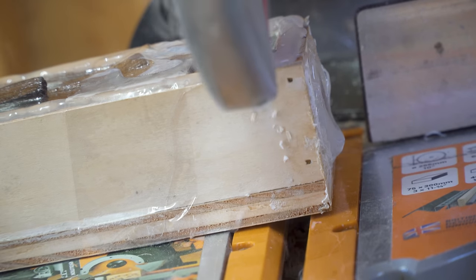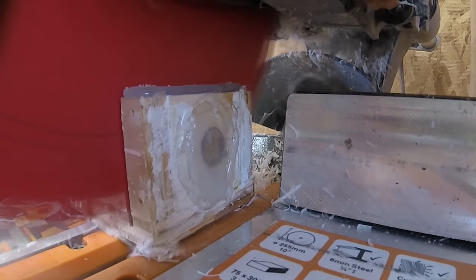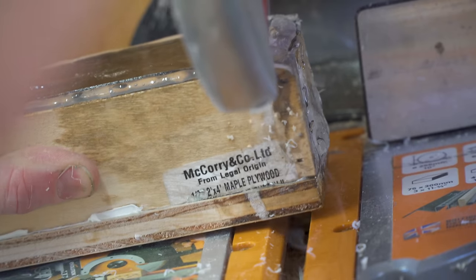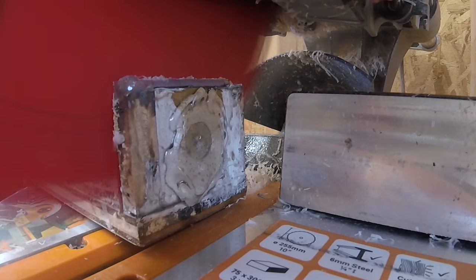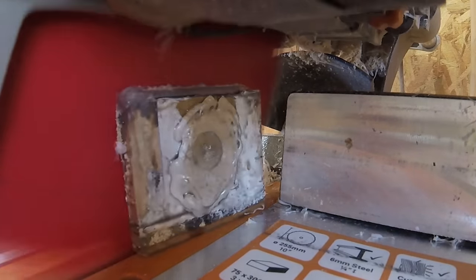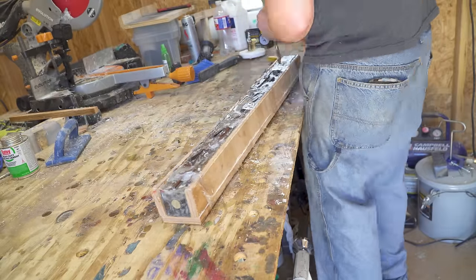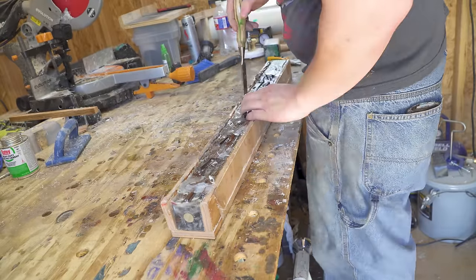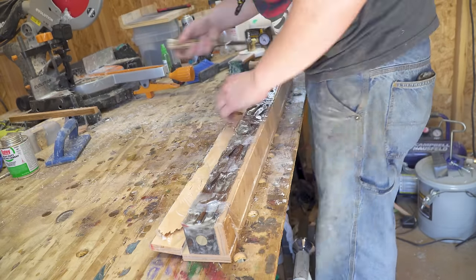The first thing I need to do is remove the ends of the mold. I designed these molds to be pretty much disposable — they're made out of quarter-inch plywood and not designed to be reused. I designed them with removing the blank as easily as possible in mind. So the chop saw and a chisel do a really good job, especially when you cover the inside of each piece of the mold with packing tape.